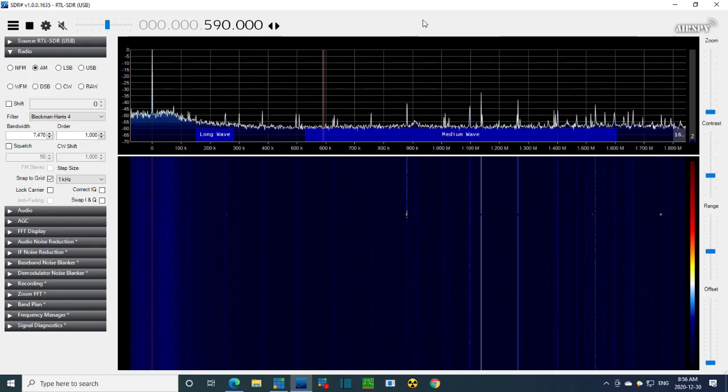Well, something's appeared already, and the B+ voltage would be next to nothing in this radio right now. Wait a minute here, I didn't have that voltmeter on. Let's just give the voltmeter a chance to warm up. So B+ is zero. How did that show up? Okay, so I'm going to raise the B+ upwards. Watch what goes on. Here we go. Going up. Going up. Look at that.